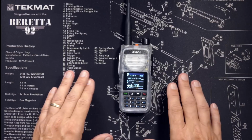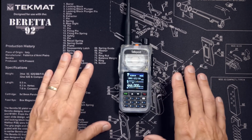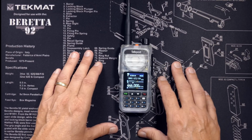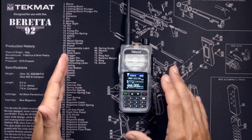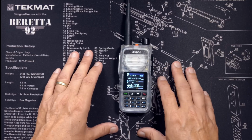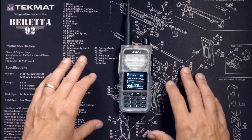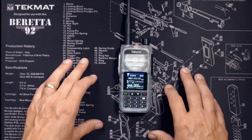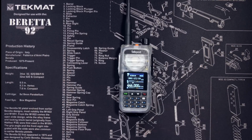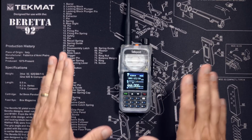And this gave me much interest and excitement because MDC, as you probably know, and if you do not know, I'm about to tell you, MDC is that data chirp sound that many high-end radios make, which is actually the sound of a digital ID being sent. There is an MDC 1200 setting in the Roger Beep configuration menu, and enabling this option does send an MDC sounding tone instead of the Roger Beep, which is cool. So being able to read MDC 1200 IDs would be great.